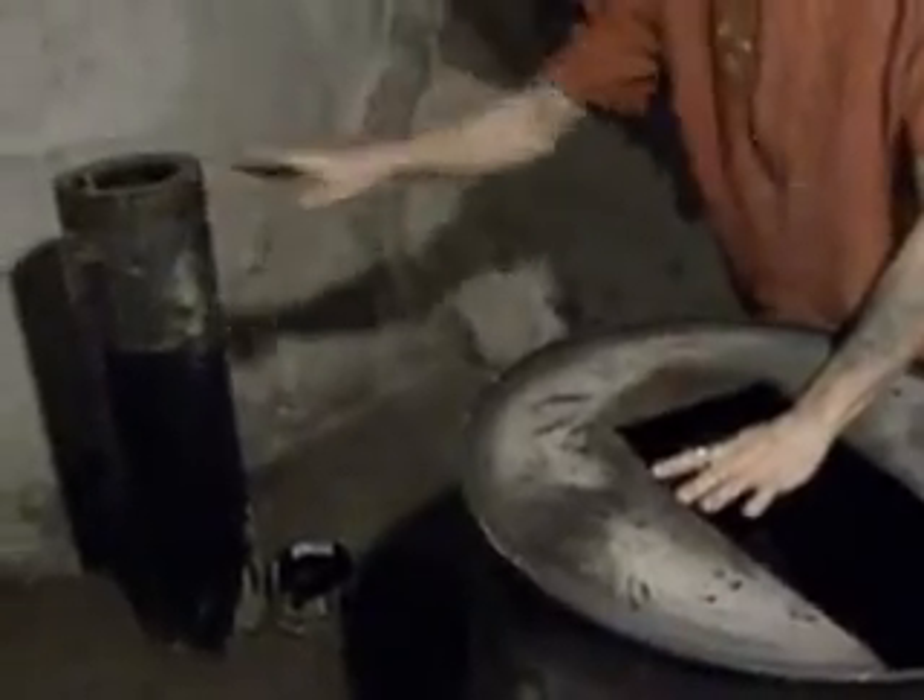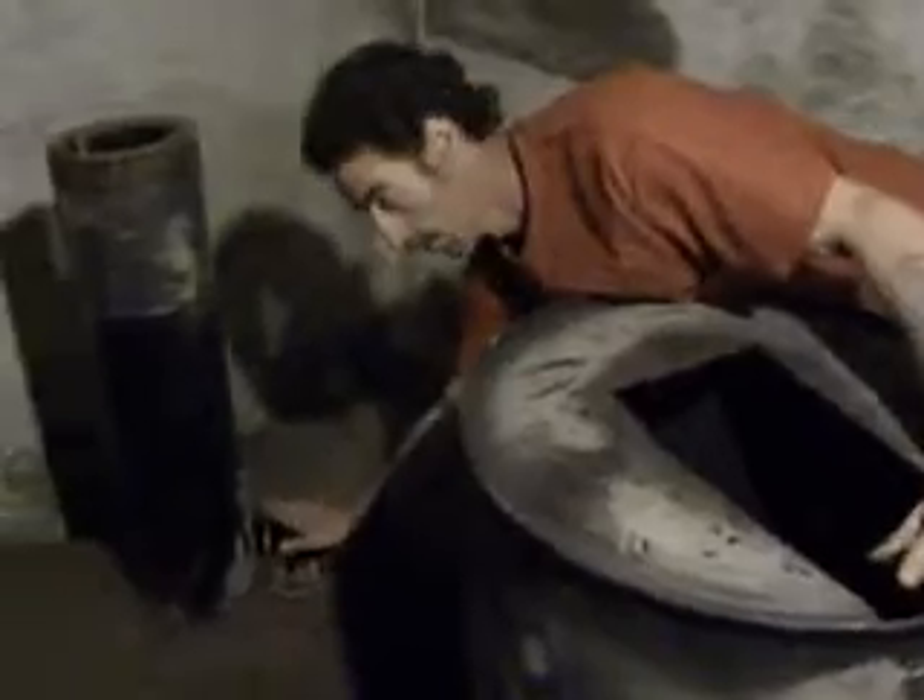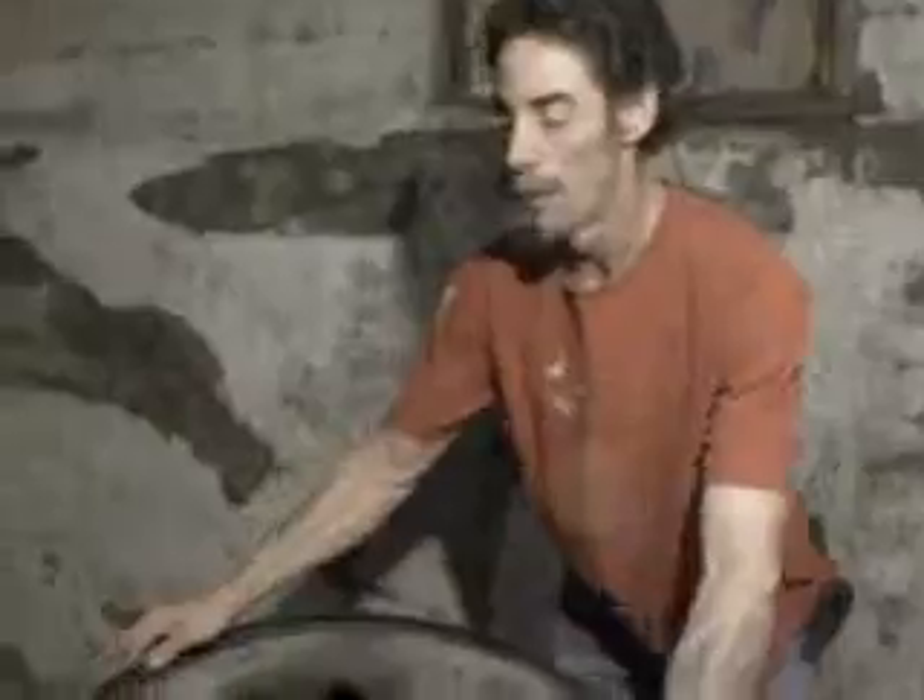I packed the bricks in with a mixture of cob. I've got a barrel — the bottom side is actually the top of the barrel and it has the holes, with caps to put in. I've cut a hole in the bottom of the barrel. This is where the central exhaust tube will feed smoke into the barrel, and over here is the area where it turns around and goes into the chimney pipe to leave.